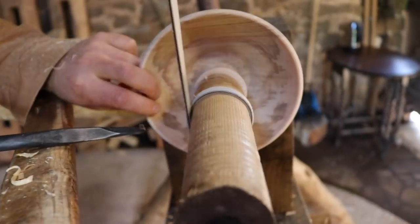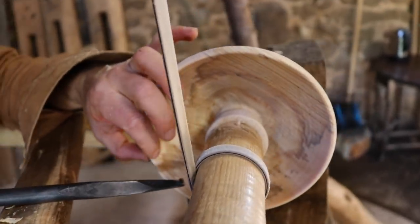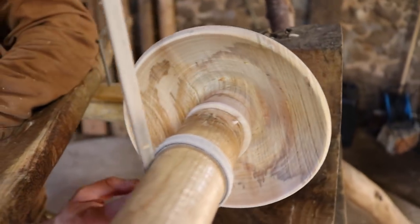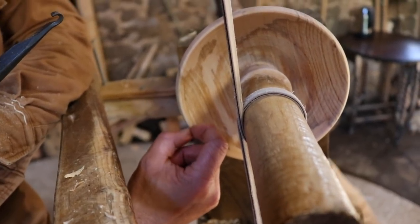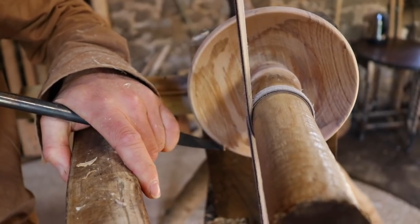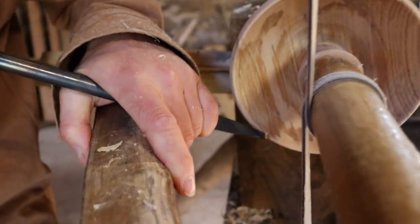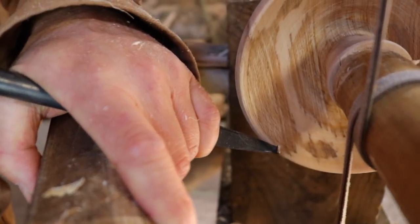Starting literally just on the inside lip of the chamfer. Basically, just on the inside lip. Now, what happens sometimes is this can get a bit thin. You can end up with a bit of an edge. And that is extremely difficult to do anything with, because trying to land on an edge with the hook, with the cutting edge, is going to ask for disaster. It'll catch it, or rip it, or spin out.